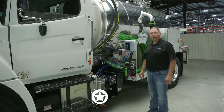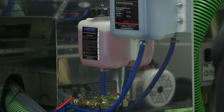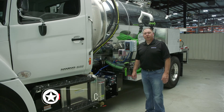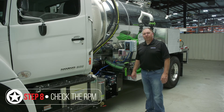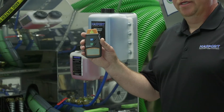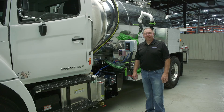The next part of your daily maintenance is flushing your vacuum pump. This truck is fitted with a Massport flushing kit — for further instructions, see our other video. Finally, know what RPM your truck should run at for proper pump speed. All trucks are different between manual and automatic transmissions. If you're unsure of your pump speed, use a digital handheld photo tachometer and check the speed at the pump shaft to make sure you run at the right RPM. That's your daily checklist.